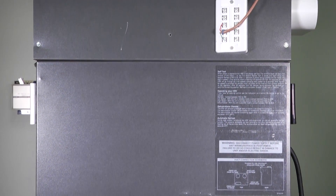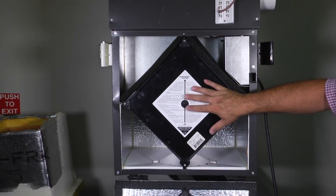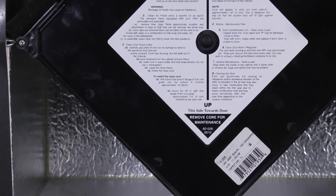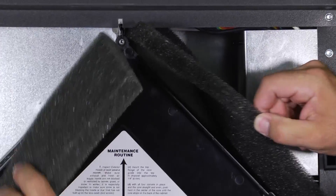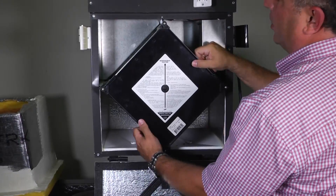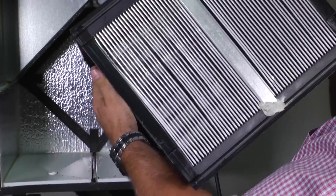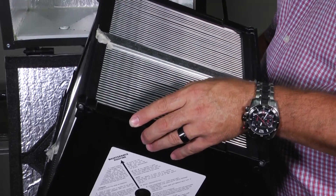You say to me, how is it possible that it can deal with the heat as well? Because inside of it, what we've got is something we call the core of the system. Really what the core is, it's a core that allows air to pass across it — in other words, it's a small heat exchanger. We have two pre-filters that are put inside that are going to filter all the air going into the unit and any air coming back to go outside. But as you can see as I slide this core out, it's just two separate passageways that allow air to pass back and forth, touch these plates, and actually exchange the heat in that air.